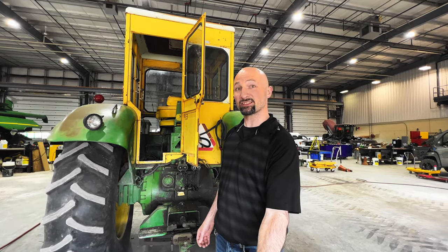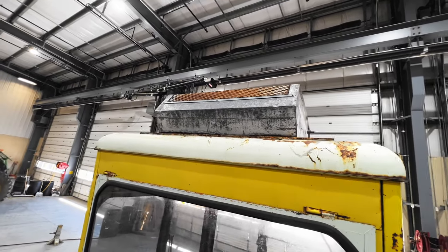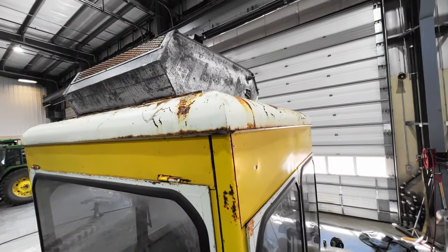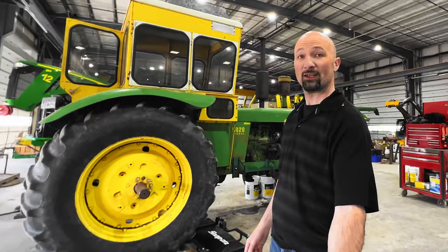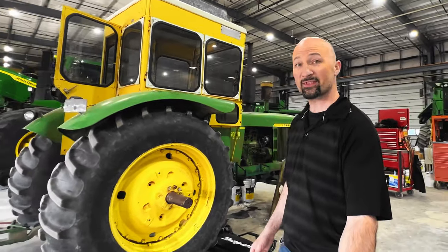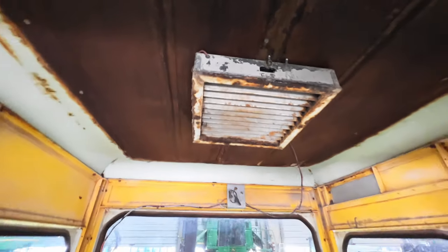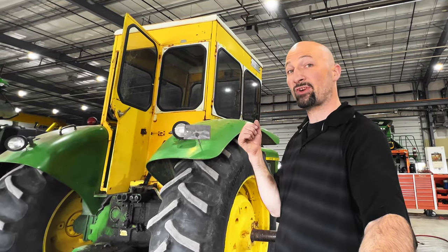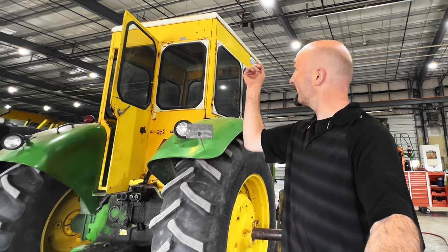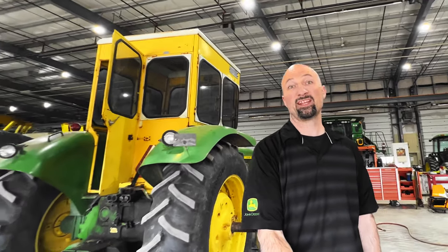Just because it's old doesn't mean people were stupid back then. They came up with a solution and it was actually helpful. It's air conditioning before there was air conditioning. It's quite a genius system and it just uses moving air and water — no R12, no R134, nothing in there that's gonna harm the environment. What they would do is pump water from a reservoir up into that unit. The fan would blow air to evaporate it and blow it onto the operator. The funny thing is that sometimes the drain hose of the excess water would get plugged and water would pool up there, and if the operator hit a bump he'd get rained on, or it could potentially short out the motor.